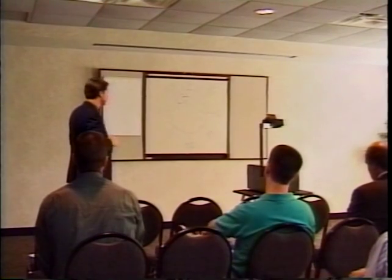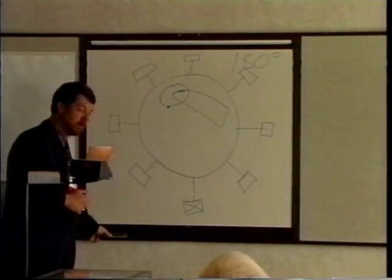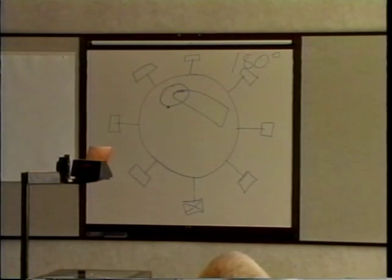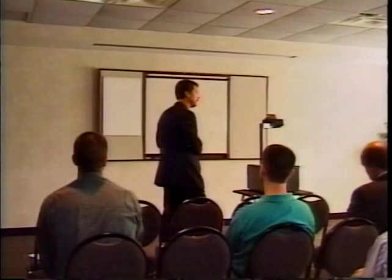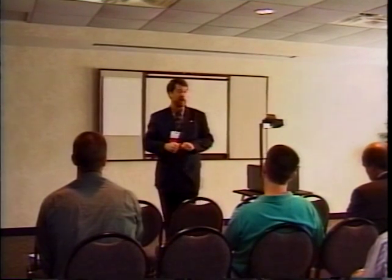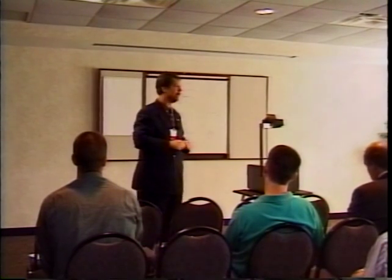Some different tools you can use. Of course, if you have screws on the balance wheel, you've got the undercutters, which are a real nice way. You don't see the weight that you removed. You can't see it anywhere, and that's probably the best. Other than that, if you had to do it in a lathe, but there's all kinds of other ways that people have invented to do it.